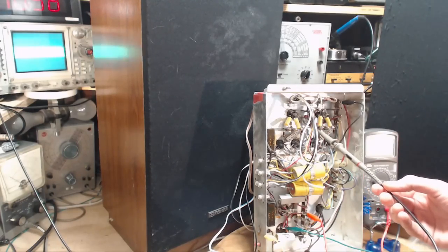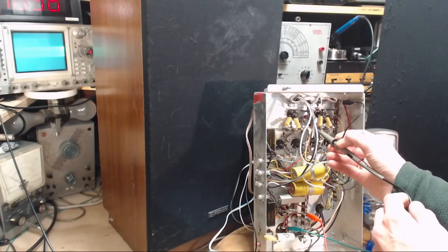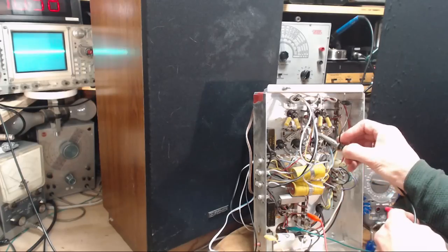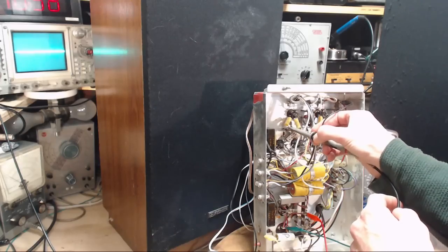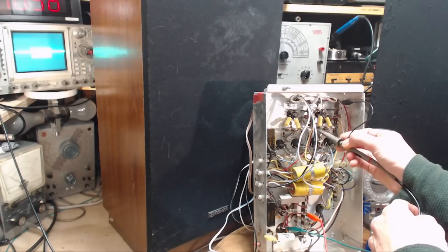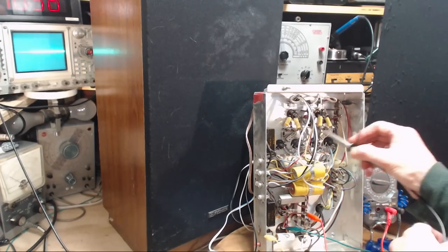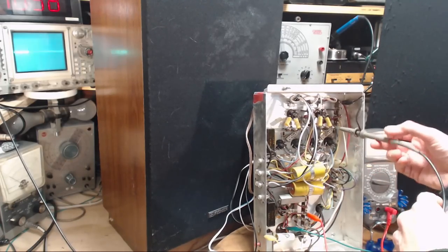Oh my gosh. Wait a minute, this is the other side now. Why have I got this big RF looking bar here? What happened there? Let's go on this side. Nothing there. Let's go over here. This is the other channel. You see the bar? Heard a hum come in. And see the bar? I see it. Come back here. See a bar? I see it. This is the odd guy out. No bar. No bar for you. Bar for you? No bar for you.